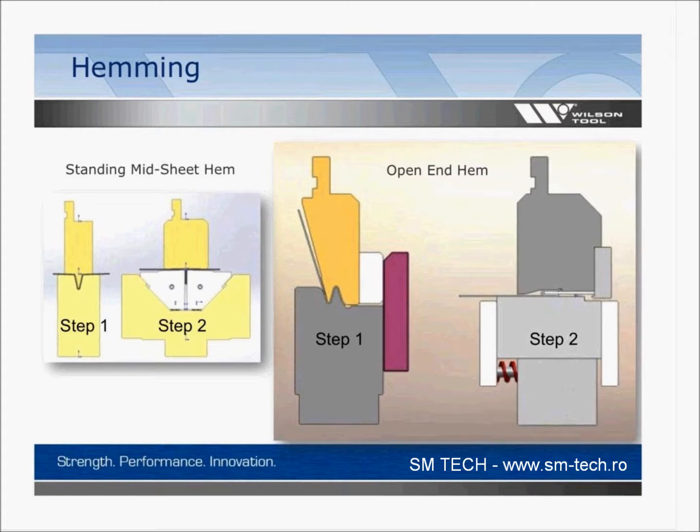If you were to put a spacer in there though, and you're hemming over the spacer, potentially you're going to have that spacer stick. So if we put a spacer in a tool, generally what we'll do is fix it to the tool in some way so that when you pull on it, you can pull it out and it doesn't come with the tool. In the manual, crude method you're probably using before you buy something more streamlined, you're taking a piece of material and putting it in there, and the longer it is, the more you hem over it, the more it sticks, and now you have to find a way to get the spacer out of the hem. That becomes more of a challenge than actually making a part. So we will put something in there that's more fixed so that you can remove it from the material. But no, I don't know that we've experienced a lot of binding issues with that particular design. Hopefully I answered the question there.